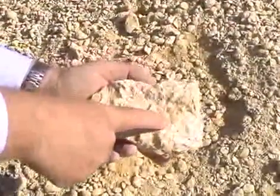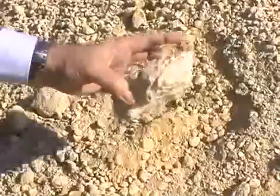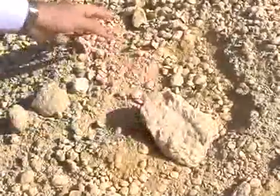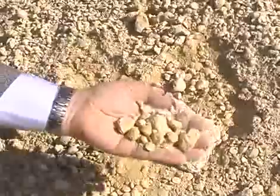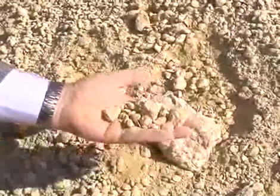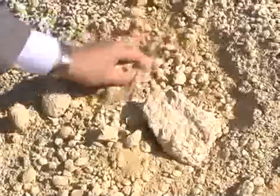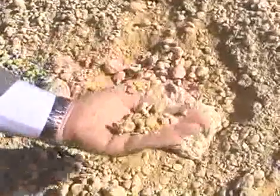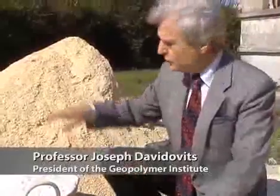The limestone we used consists of fossil shells called nummulites, like those in the Giza bedrock. Like in Giza, our French limestone is so loosely bound it doesn't require crushing. But unlike in Giza, it contains no kaolin clay. We heap the cement additives, lime, natron and kaolin clay, near the limestone.